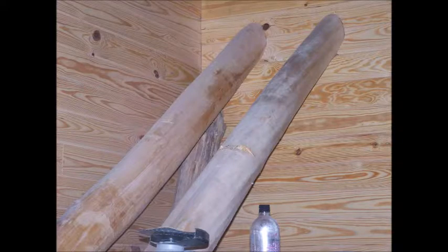I've done all the layouts for the stairs on a 1x12 stringer, and it's just sitting out of view where you can't see it, but I use that to project my lines across the log stringers, and my steps will go in there. And I'll lower my steps, notch and scribe my steps, and lower them down to that laser line. And also I'll measure from the wall the distance that these steps have to be out in order to make the right step width.